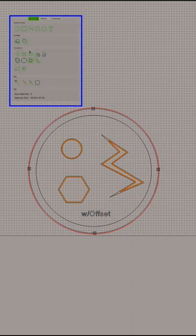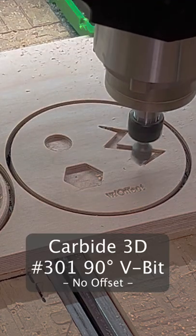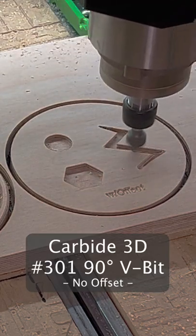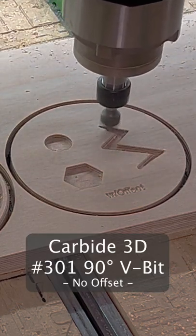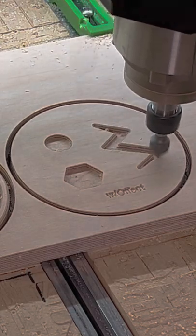Be aware of whether you want to chamfer the inside or outside of a particular contour you've previously created on your part. This is with a 301 90 degree V-bit. It's running along that chamfer line with no offset, which puts it just outside of your part or your pocket